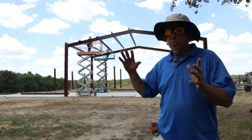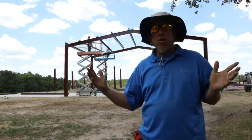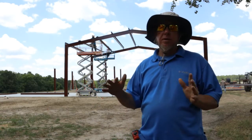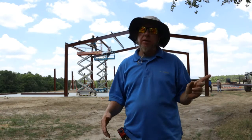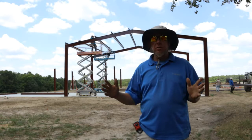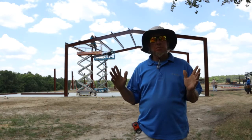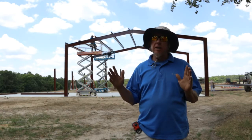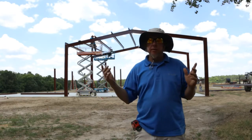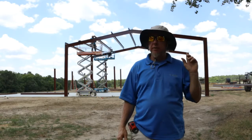When we get the whole box tied together, then we'll go back in what I call a racket. We'll level all our corners and make sure it's all right. Sometimes the anchor bolt's a little bit off. You may get one or two posts in the middle that's leaning one way or the other, but if I get my four corners level, that's pretty much all I can do. Every once in a while one of the posts would be leaning in or out, and then we go back and put a chain on it and pull that one in or out with a string down the eave.